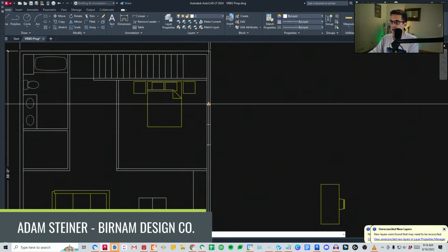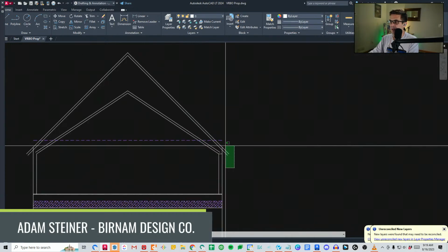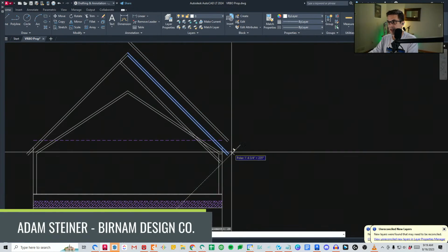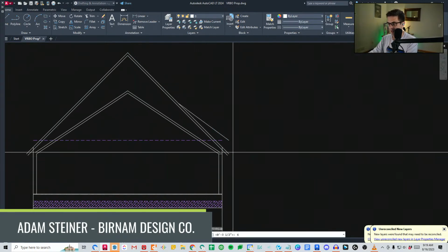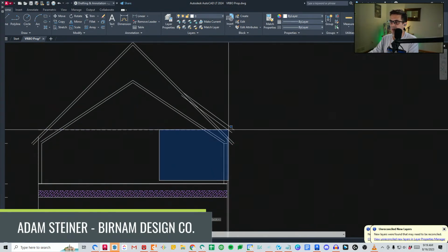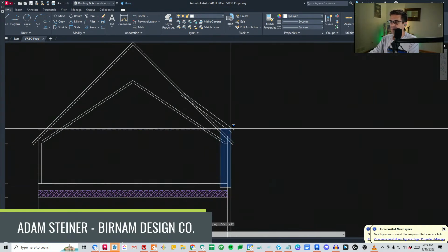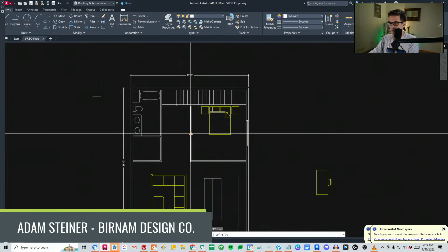So we'll do a dormer there. What would happen is this would come up a couple feet and just be a shallower slope back to the house, if we're thinking back to our cross section. So then that area of the bedroom has all 8 feet, so you can get a nice big window there.